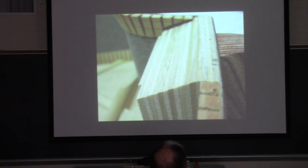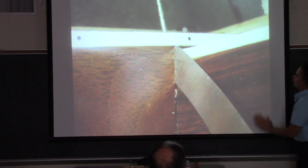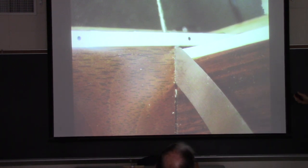So there's just one more shot of that angled heel block with the back off the guitar. Okay, another concern with the mortise and tenons is as you're pulling them out. When you pull them out, I tend to pull up and out this way. It's not like a dovetail where I'm just going to go straight up. Because it's a mortise and tenon, there's no dovetail, there's no angle to prevent you from pulling, so I tend to pull out a little bit at the same time. But what I find quite often is that this little piece of binding, the way they use so much adhesive in there, likes to travel when you're pulling it. So just be aware of it. And as it's happening, I just get a little thin feeler gauge in there to try and break that glue joint, and that's all.